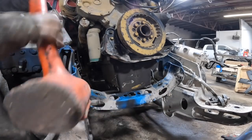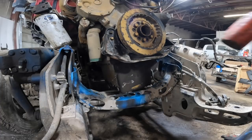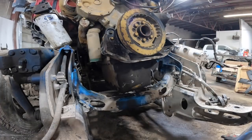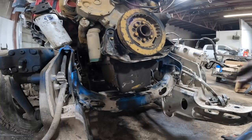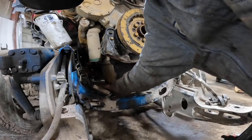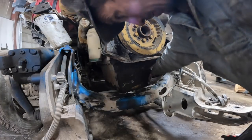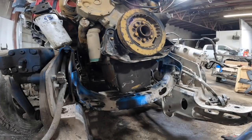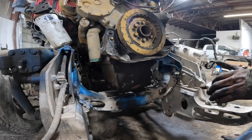But anyway, I still got the back mounts to figure out. I was going to pull what I did on the Peterbilts. I just mocked my engine up on the front mount, and then I bolted my actual engine mounts to the mounts on the bell housing. Then I lined them up with my holes and marked my holes, and then I drilled them. It was really, really simple. But on this one, it's such a pain in the butt to get this engine in and out of there that I'm just going to have to do some measuring, and we're going to have to find a reference point somewhere to measure from. That way we're measuring the same from both sides. Something like a fuel tank mount, something that's going to be the same on each side of the frame flange, each side of the vehicle. And we're just going to have to drill them from the outside with the mag drill. I don't want to pull this thing back out of here.